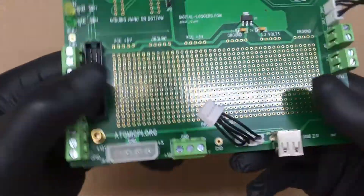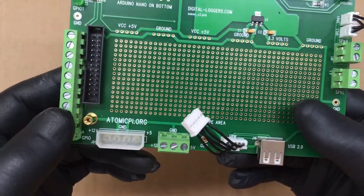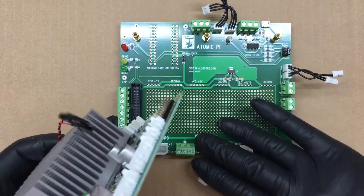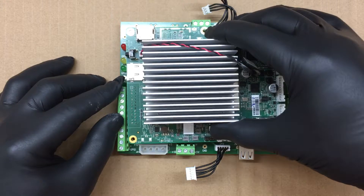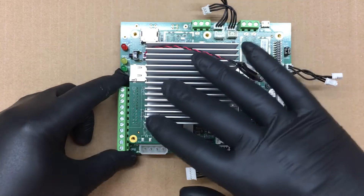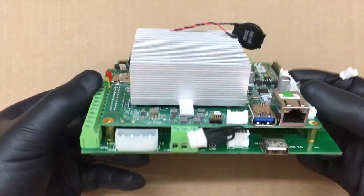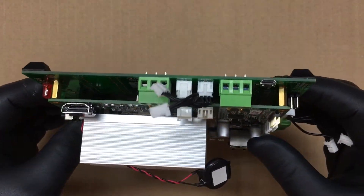I powered this with five volts just to test it — put a ground there, five volts on that side — and everything seemed to work fine. If we just get these jumpers out of the way, which you really don't need to hook up if you don't feel like it, it just sits down onto the GPIO pins. It comes with a bag of hardware and screws to mount it. That's what it looks like with the Pi sitting on there mounted.